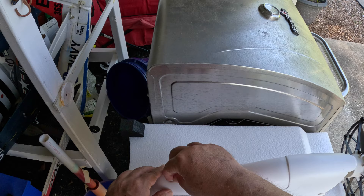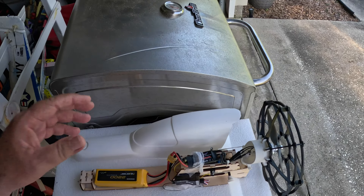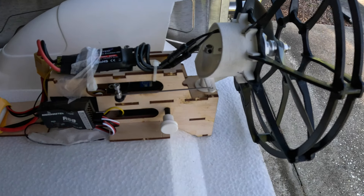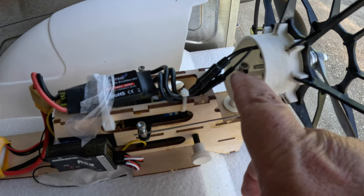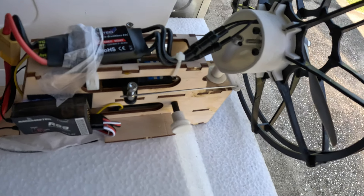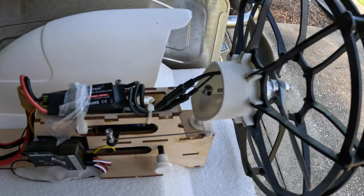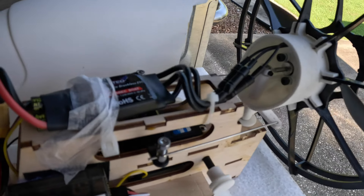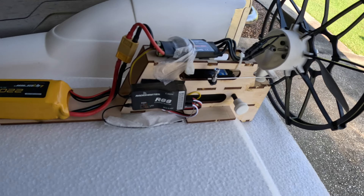Yeah, what happens is you turn this like that and that lifts out and pulls off — there's everything. A couple notes: you've got to drill the holes here. I had to drill out this shaft to make the pivot shaft fit. The included motor mount screws are too short — they're like 6mm and you need 8mm. I had some RSTL 10mm screws, so I put a nut on the back to keep it from going in too far.